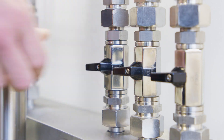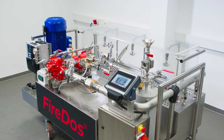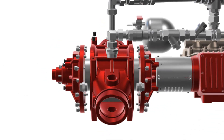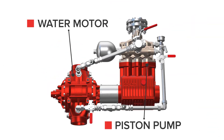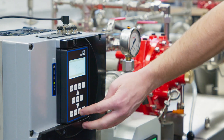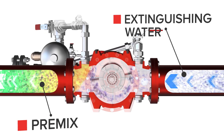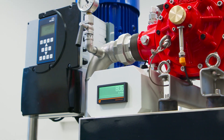What's actually happening here? Let's take a closer look at the proportioner. The proportioner consists of a proportioning pump and a water motor. When the extinguishing water pump is switched on, the water flows through the water motor of the proportioner, prompting it to rotate.